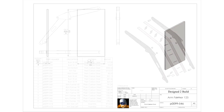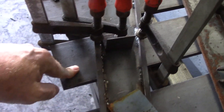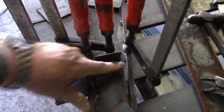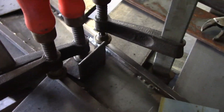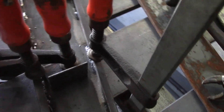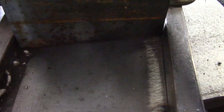Now I'm just trying to explain what I'm doing here. I've clamped the side here to the welding table, or at least to one of the slats because the slats are movable. Clamping it to the table pulls that down nice and tight onto the slats and I'm pretty sure that won't warp — it's half inch thick, 12 millimeters. And then I've clamped a piece of angle iron onto the center of that to provide me with a vertical reference. And then I'm taking one of these corners and placing it in there, making sure that it's nice and flat down against the face of the sheet metal.